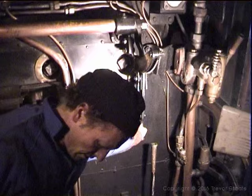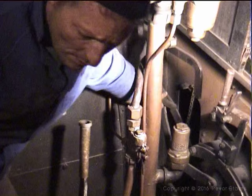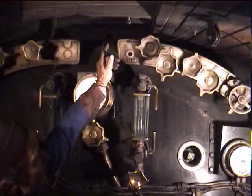Drifting valve by the driver is closed. When you get to know the controls, that is the drifting valve. All the locomotives have them. Just check it is pushed forward and closed. Ejector, injector, lubricator, drifter, etc. The drifting lever we operated down there, this is the spindle for it. See that it's closed. Closed off shut, right?